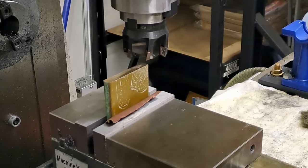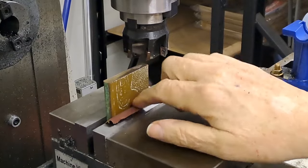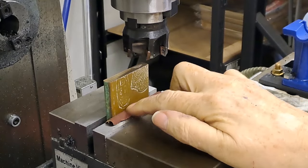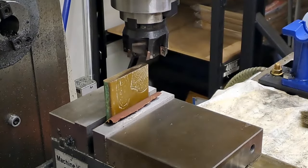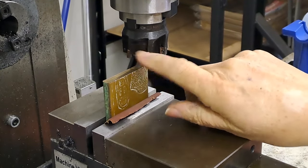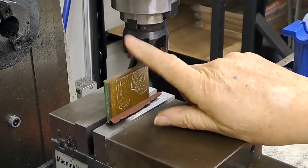Right, guys, machine, everything's cleaned down there. Got the piece in the vise, got that original machined side down. And as you can see, because this is an uneven surface, I've got a little bit of emery cloth in here just to give it a bit of bite. That's nice and solid. I've tightened the vise up quite well. I've just touched off. Going to go down maybe 0.2 of a millimeter, just because it's a saw cut on a machine. It's not likely to be dead even.